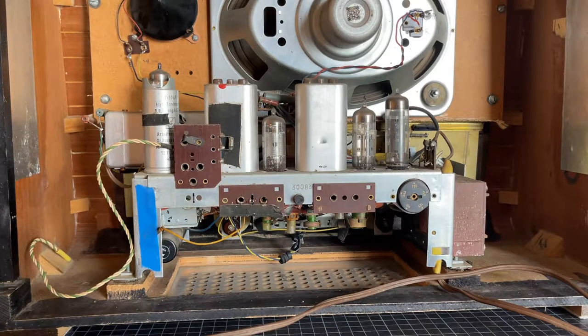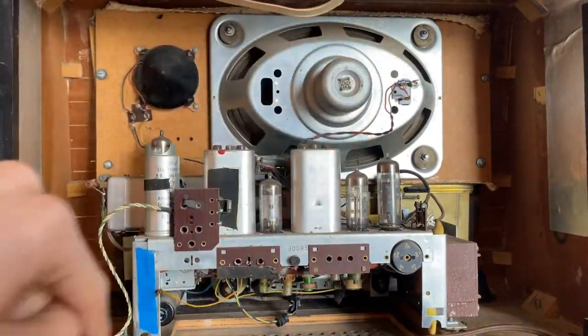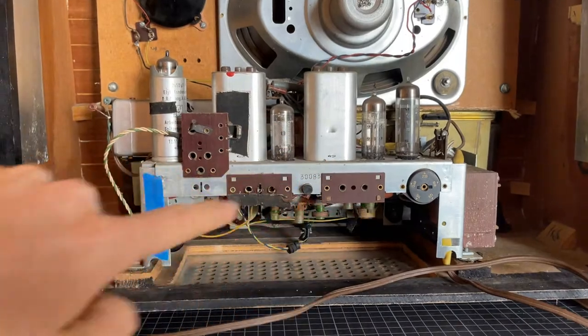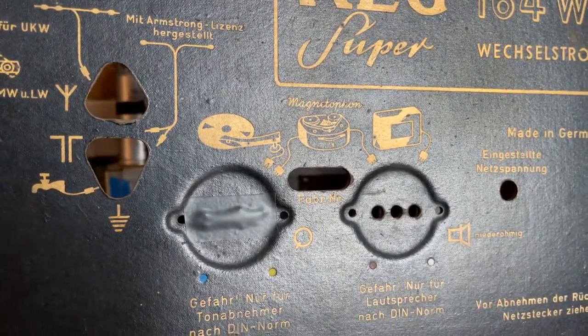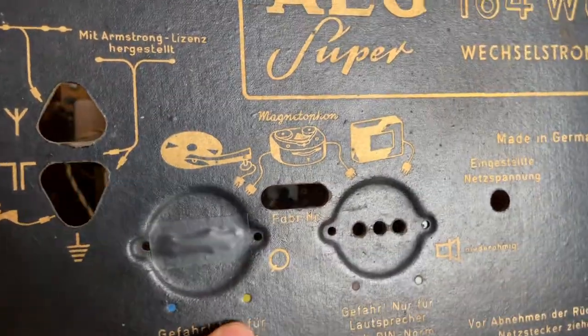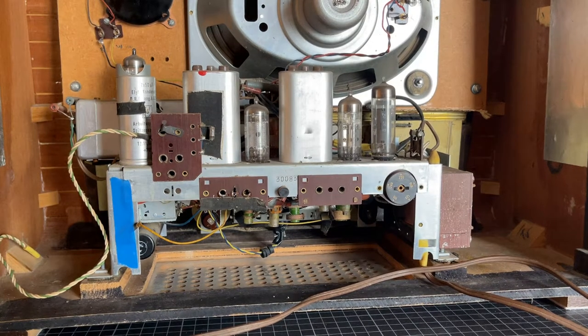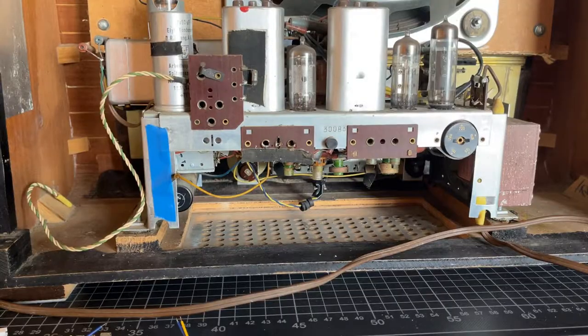I think there are two ways to go about doing this. Option one is having these wires directly routed to the headers of the speaker and the tweeter as the second speaker. Or we can use these connections here — not all radios will have this, but since this is a fancier model it has features where, if you had an external turntable or tape deck, you could plug that in and use the radio speaker as an external speaker. Since I don't have a turntable, I feel like these headers right here would be perfect to use for these cables.